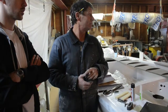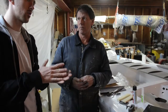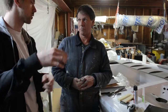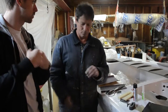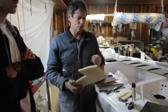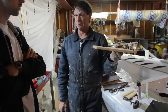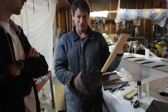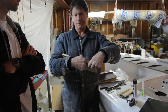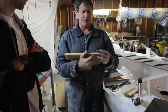But I have some sheet stuff upstairs. Okay, and then what about where they're pivoting off of? Can we still just locate some compression tubes? So you could wrap the whole arm before you put your pivots on it. Make sure you got glass everywhere. Glue your pivots in place, then wrap your tubes on top of them. That way you know that you got glass.